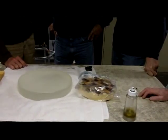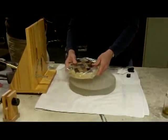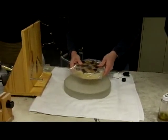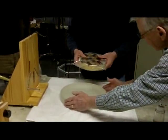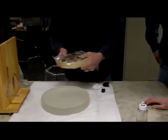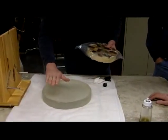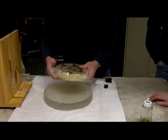Right. So tell me how you maintain your focal ratio as you're working with a small tool. Do you use the mirror on top side? No, it's the tool on top the whole time. So I've alternated between tool off center, working it like this, and then turning it, and tool in the middle. Well, you're working it off side, right? But you turn the mirror with the normal turning technique of walking around the corner and turning the mirror and turning the tool. Okay. But doing this action will take the outside edge down, and then doing this action brings the inside down.